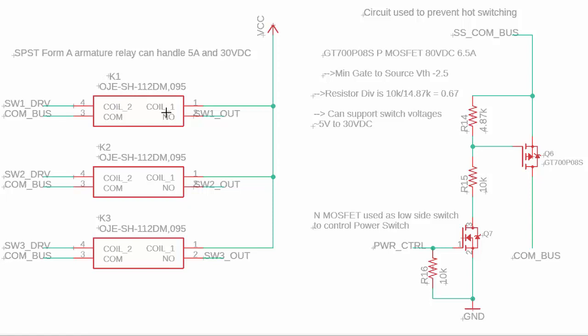Here's the scenario: K1 is closed, K2 and K3 are open, with 5 amps flowing from the COM bus drive to switch one output. If we want to open K1 without hot switching, we first turn the N-channel low - it acts like an open, removing the correct bias from the P-channel Q6, which then opens and cuts off the always-on signal. Now no current flows through K1, so we can safely actuate K1 to the desired position, or actuate another switch, then close Q6 again. This combines solid-state switching with armature relays to get the best of both worlds - the air gap isolation of mechanical relays without the arcing damage of hot switching.